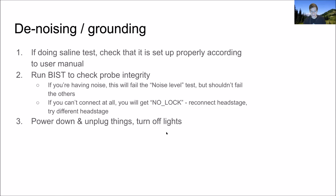Double check your soldering and referencing. Bill Karsh, the Janelia tech support person for Neuropixels probes, says most problems he sees are because people have not done a good job and have a crappy soldering or referencing joint. Sylvia's slides yesterday emphasized how easy it is to get that wrong — make sure the connection is good and use a multimeter to check everything.